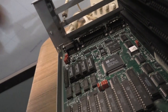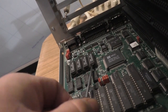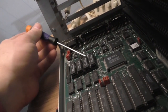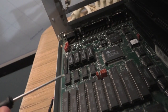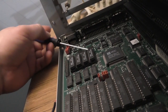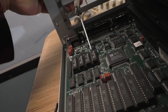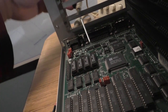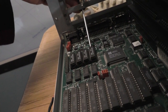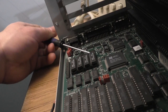I really wish I had a chip puller — that would make this job a lot safer. What you don't want to do is pull them all the way out from one side. That is how you bend pins. I'm also going to look up what these part numbers are — if this doesn't work, I'm just going to replace them. I believe these four are the onboard video RAM. This machine has about 256 kilobytes onboard, upgradable to one megabyte, and that's what we've got here — one megabyte.